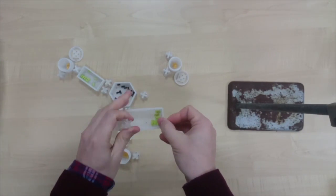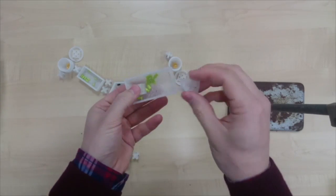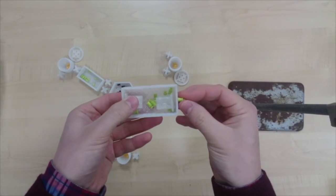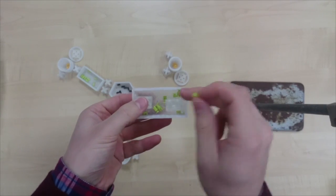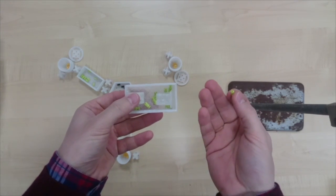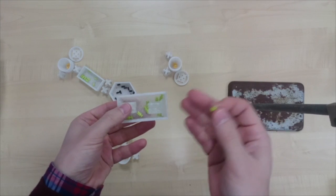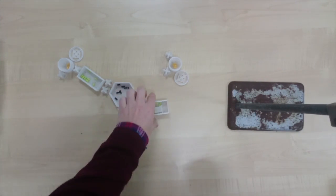So this is a mold. We will stick one on each side and maintain them with the clips. The clips are important because if you don't put all of them, then some silicone will leak out of the mold. Then we'll pour the silicone and wait for a day, and at the end, we should demold the soft part that we'll be able to fix between the XL320. So let's mount this.